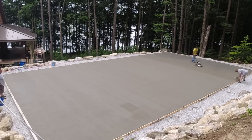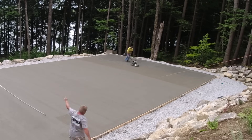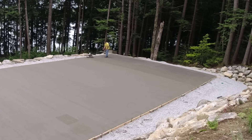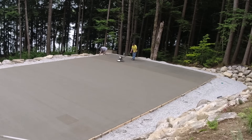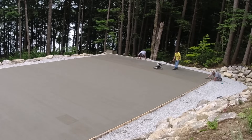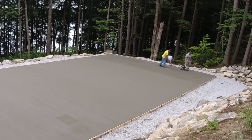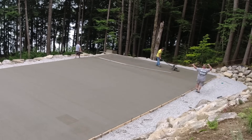I think this is Tomahawk's version of their gas-powered mini trowel. I believe they also have a battery-powered version of this same trowel — I've never tried that one but I'd like to. Maybe if they send it to me I'd try it and put it on video. All in all I was really happy with how it worked versus getting on there with knee boards and floating this by hand — this thing was a hundred times easier. If you do little jobs like this and some broom finish stuff, this might really come in handy. It actually has a lot more poles — I have three or four more poles about four to five feet long each that I could attach. I could reach way out without even having to step on the slab — I probably could have done this whole slab from the outside just walking around with all the poles.